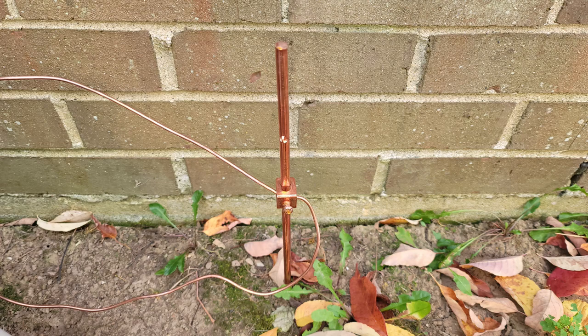Make sure you get some grounding in your property. If you really don't feel like you can get a full 8-foot grounding rod, go with two fours or three fours, something like that. You just want as much metal in the ground as you can get, and almost anything is better than nothing. You may not be able to have the perfect setup, but almost anything is going to be better than nothing, and you can still save your equipment from other kinds of incidents that might be damaging.